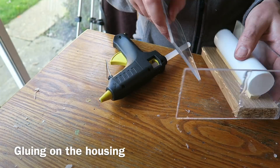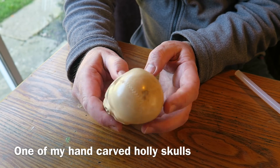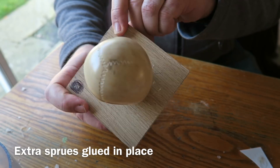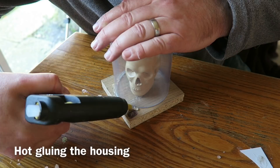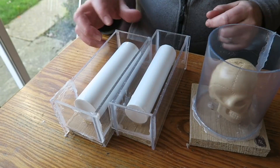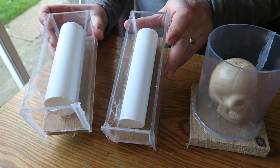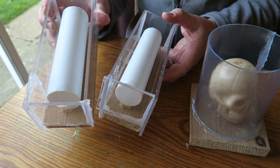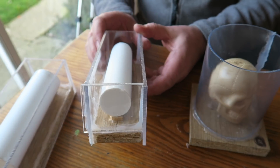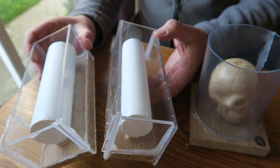Here's a skull I made quite a few years ago, carved out of English holly - a lovely wood if you can get it dry without splitting. I've put a screw through a base, screwed the skull onto that, and added some extra little sprues, then glued a cylinder around it to form the housing. Here are the finished mould housings with the masters in the middle. These two are for specialist blanks for upcoming projects - what I'd call stingy blanks because they're round, so you're not wasting resin on corners you'd take off on the lathe.